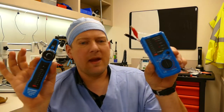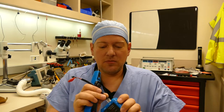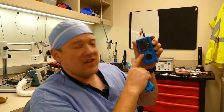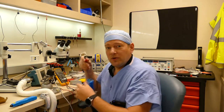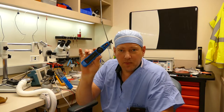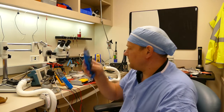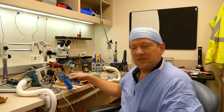I got this network tracing kit off Amazon — I think it was $10 to $14. What you do is take the wire with an RJ11 and plug it into your tracer. I'm going to set the tracer on scan, then connect the red lead to one of the wires. Turn on the detector pen — it's got a detecting tip — and press the scan button. The normal tone you should hear is an oscillating tone.